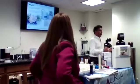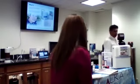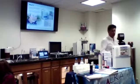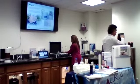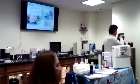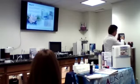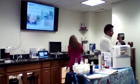Sometimes it takes an hour in the Philippines, or up to 4 or 5 hours. In case the electricity goes out longer, the only thing you need to check is the clock. If the clock matches the current time, you don't do anything. If it's not right, it's really simple to adjust. Press set clock, the hours blink, and you adjust them. Next will be the minutes, and you set whatever the minutes are. Push next again, and it's done.